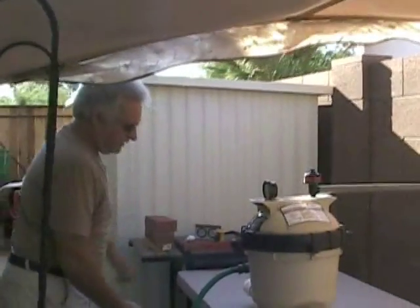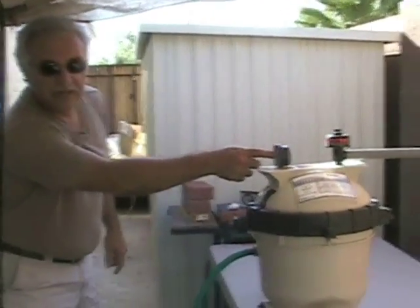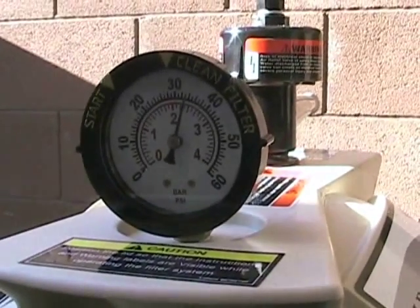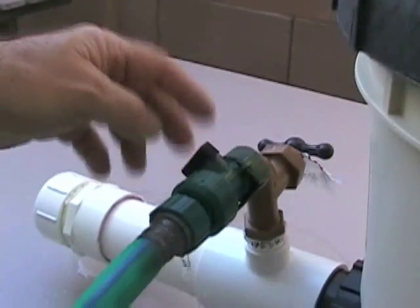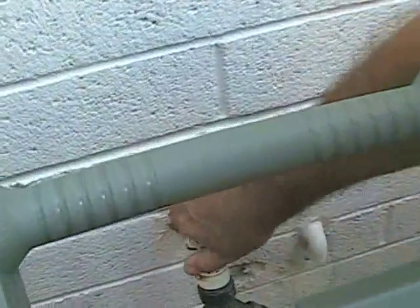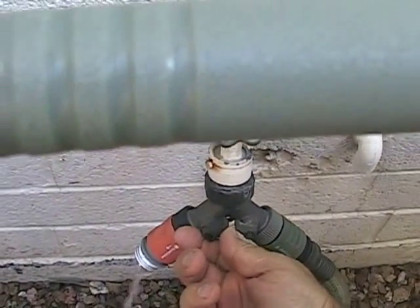It's time to get the device out. I'll show you how I actually go through the depressurization process. First we check the pressure — make sure it's still what it was. You can see it's still two and a half bars, so it held pretty well. Now I'm going to check the valves — the input valves for the source are off. Now come here and I'll show you how I'm purging the system. Right here I have the main source — turn that off, and then I purge. That has now purged the system.